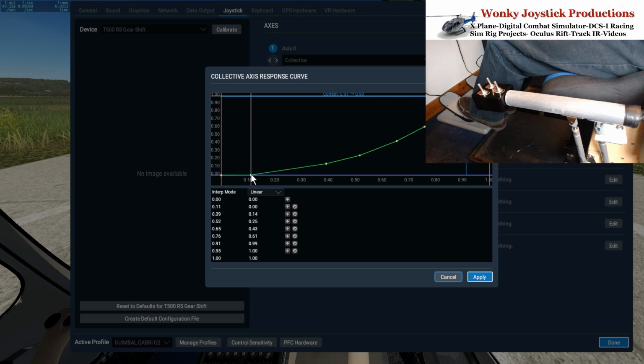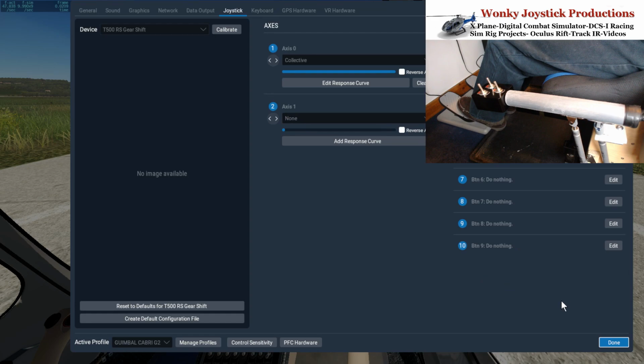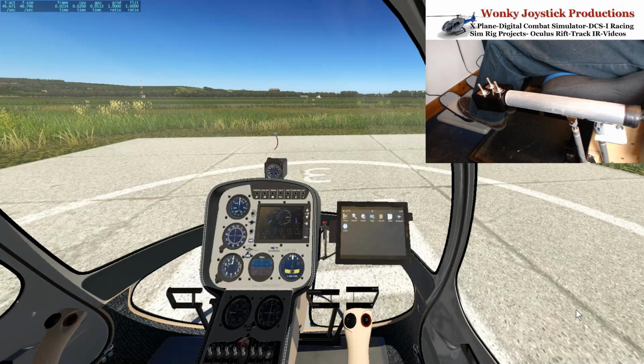And the reason was I had to move the Hall effect sensor closer to the magnet. But I do get a very, very good response over that distance. And it's also the full travel of the stick. So it works very well from that point of view. So I tidied everything up. I've done a much better job on the back of this.